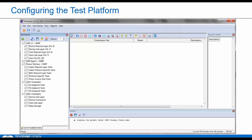So a lot of the functionality in Type-C is optional. Whether you need to pass some tests depends on whether you support certain features, things like USB data, alternate modes, sourcing VCONN. All of these add additional assertions to a given test. With PD, we had a similar challenge in that to test a device, we needed to know what it supports. So the compliance group created that standard format you probably all know. It's called the VIF, which is just a text file that you fill out, and it becomes a spec sheet for the device itself. It's used by the USB-IF to track capabilities of a device coming in for certification. And then we also use it for testing.